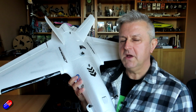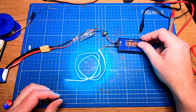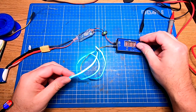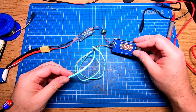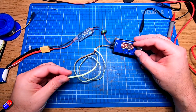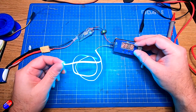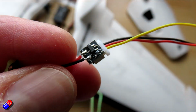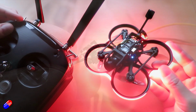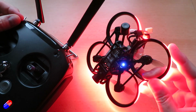However, I was playing with mine here and I found that you could do something pretty cool with it. You could actually plug it directly into a PWM output, and that PWM square wave, which is generating the pulse, and the pulse gets wider as you increase the PWM value, actually turns them on and off, because part of this little COB LED is this little circuit board here, and that is the really clever part. If you put 5 volts on the yellow wire, then the COB LED strip illuminates. If there isn't any voltage on that wire, then it doesn't illuminate.